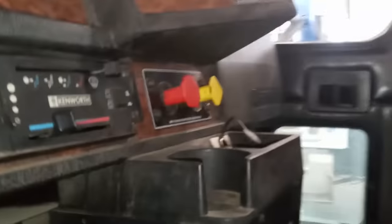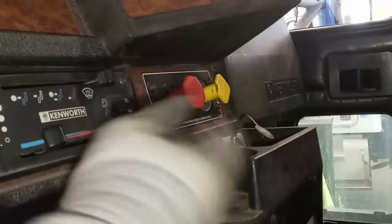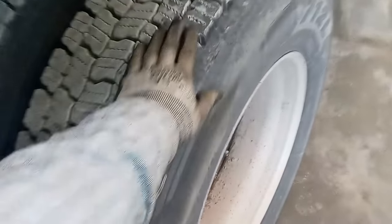Destruction of the week — we have a truck, thank goodness. We've got some brakes here; it's a troubleshoot brake system. With the parking brake applied, the front brakes don't do the parking — it's the rear ones, so those should be locked. That would appear it's not locked. This one's obviously not locked; it's just spinning by itself. This is the parking brake system — this truck could be parked on a steep hill and might have rolled down. Three of the four brakes are not working at all, at least on the parking brake system.